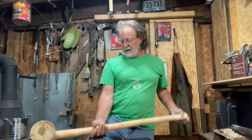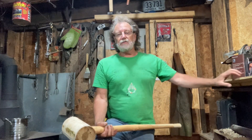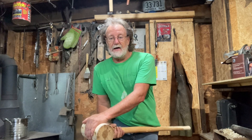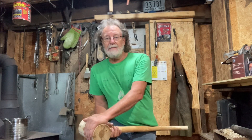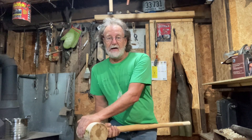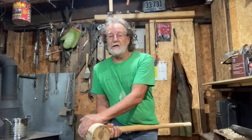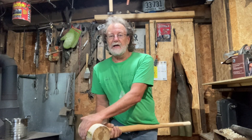One of the best ways to use these — well, just over the years you learn this stuff. An old man years ago actually taught me. When I got my chainsaw hung in a log one time, his name was Mick Massey from Bluefield, West Virginia. He said 'Mike, I'll show you how to get that out of there.' I didn't have any metal wedges, so he took my axe, cut down a dogwood tree, and stood there and chopped out gluts — wooden wedges — to drive in that log to get my saw out. I was really impressed.